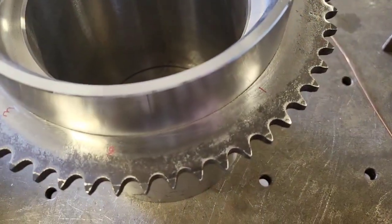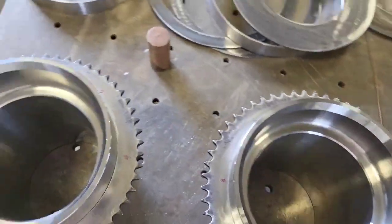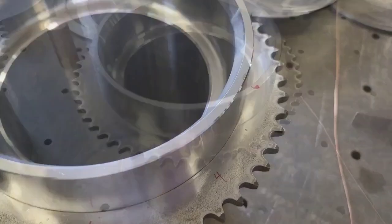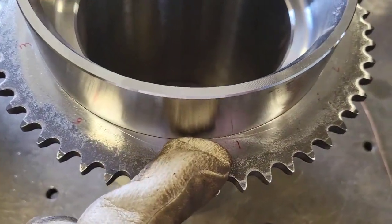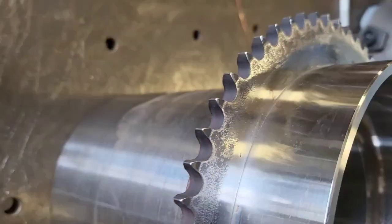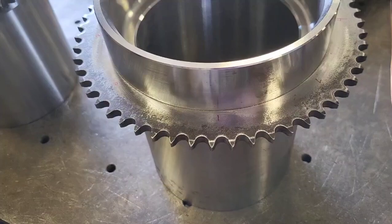I'll do small tacks because I'm going to do welds over it. With each tack I'll do one, cross over to two, three, same ones, so on and so forth. I'm not going to film too much of the doubles because that would just be redundant. Each time I tack one, I'll come over here, I'll have a clamp on this side, then I'll get the other tack and kind of spank it with a hammer with each time I go around.